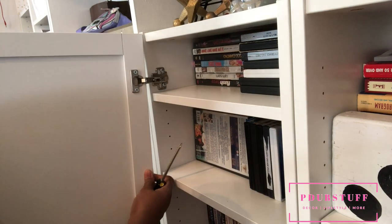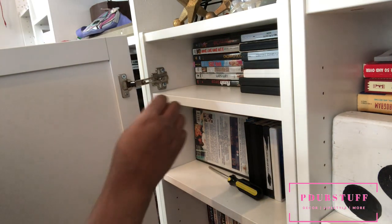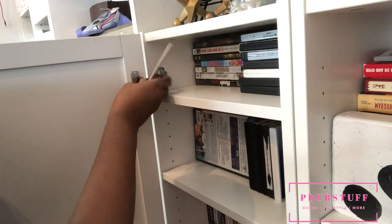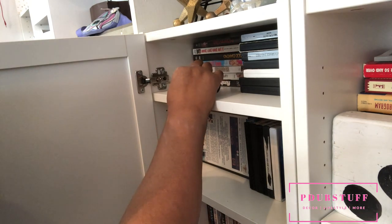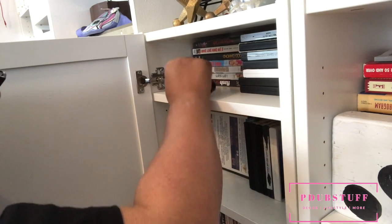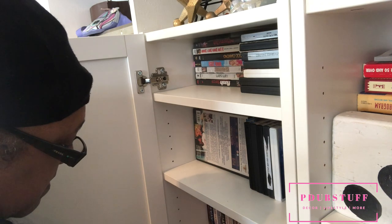The hole on that latch is to get it over the screw, as I'm indicating here, which was giving me a difficult time, as you could see. But that hole is where I'm trying to get that opening onto that screw that's mounted to the cabinet. And now you have to tighten it, which I'll eventually get. So you can basically adjust it how you want it by the tension of the screw.